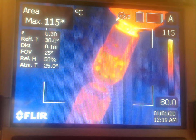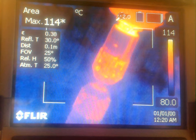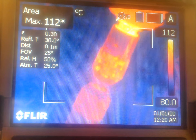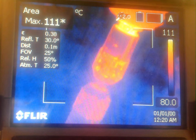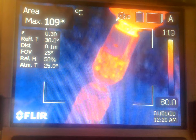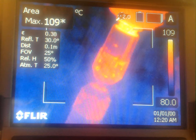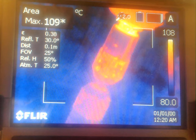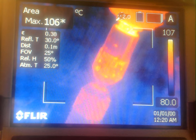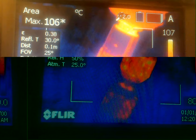This is test number three of 1.6 millimeter outside diameter copper being deposited on high polish DuPont 951 LTCC as fired. I'm depositing it at 30,000 RPM and at a surface feed rate of 15 millimeters per minute with an X to Z feed ratio of 80 and a total X feed distance of 10 millimeters with a plunge distance in the Z of 0.125.